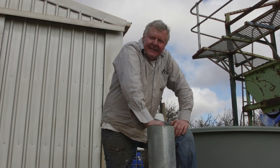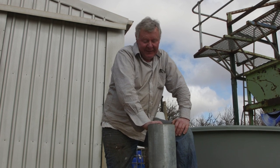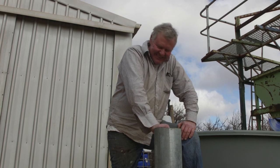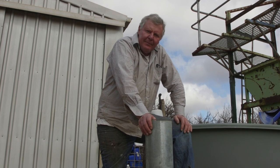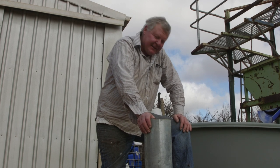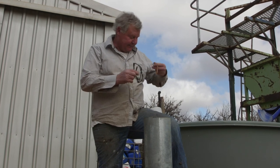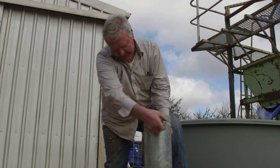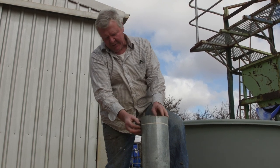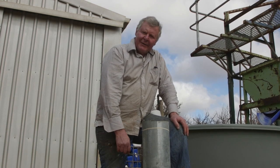This wasn't my effort, by the way. Because when you're cheating on the farm and you've got a fitting, this thing slides in and it doesn't really have to be too square. I was trying to work out how the heck am I gonna measure the pipe and make a nice round circle to mark when I want to cut it off. I've come up with this idea - if I got a rubber band and stuck it around the pipe, then get my tape measure, measure it all, and draw around where the rubber band is.